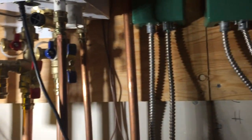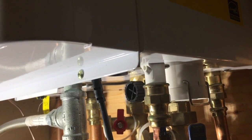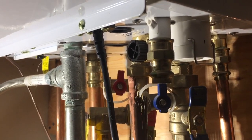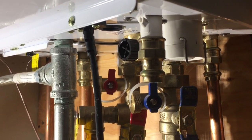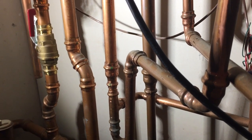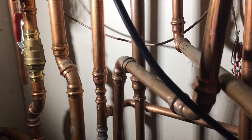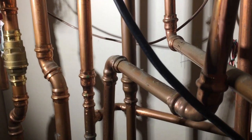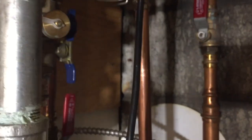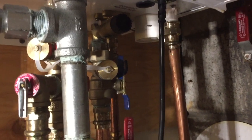See, here's the thing. I don't know what happened yesterday. Was there any gook on this thing or maybe the line was clogged? I have no idea. I just know that the first symptom was this joint. It was spraying out onto that thing. And I looked and saw, hey, that's rusted. That's been doing that for a while. And then in about 6 hours, this thing just rotted. Well, you know what? This was probably already rotted, just like that one over here. So obviously, we can't use copper for the condensate, so we're going to change that. But that's all this is.